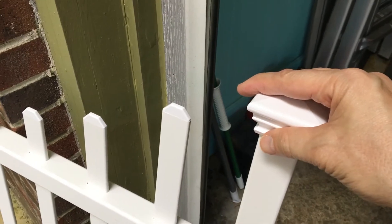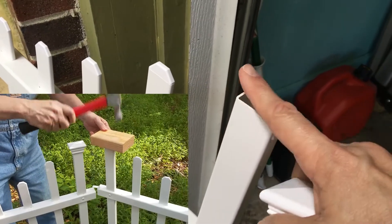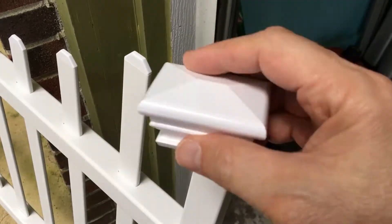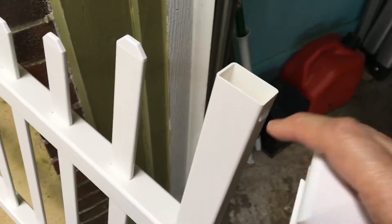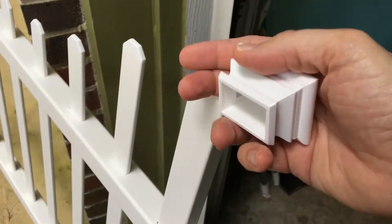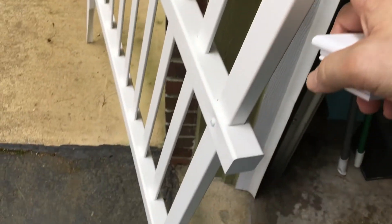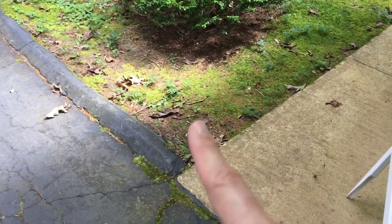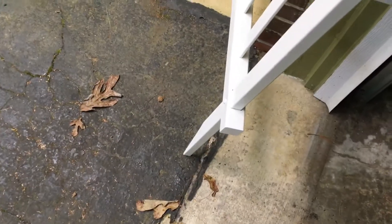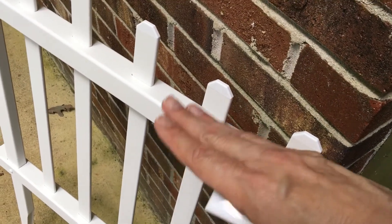Don't make the mistake of putting on the end caps yet, because you still need to put this post into the ground. To do that you'll probably have to hammer — put a block of wood on top and hammer down. If the cap is in the way you're going to break it, because it clips and locks into position on two sides and is very hard to remove once on. You may have to water or break up the soil if this spike — remember it's just plastic — doesn't want to go in. Once your spikes are in, put a level across the top and make sure your fence is correct.